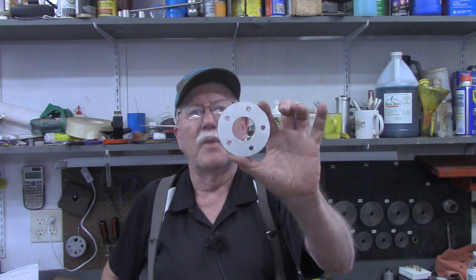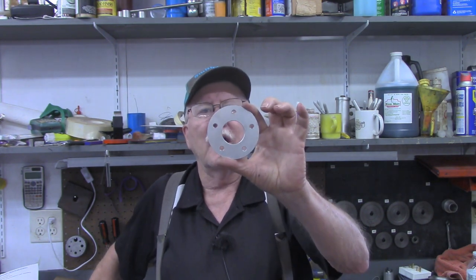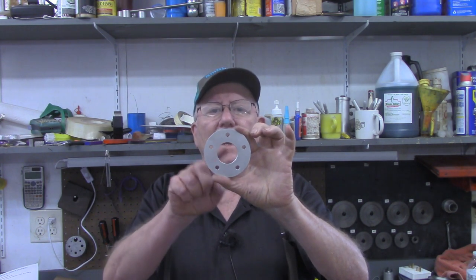Hello and welcome back to the Tin Barn. I'm Pragmatic Lee and in today's video we're going to take another look at bolt hole patterns. If you recall in the last video I did in this series, we had a bolt hole pattern that we wanted to replicate but we did not know the diameter. I pointed out that two things you absolutely had to have to create a bolt hole pattern: first, how many holes were in the pattern — in this case there were five — and second, what is the diameter of that circle, the diameter of the bolt hole pattern. In the previous video we could count the number of holes but we had no easy way to determine what the diameter was.